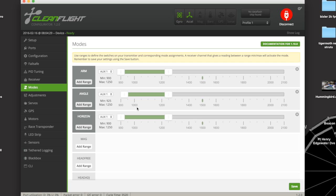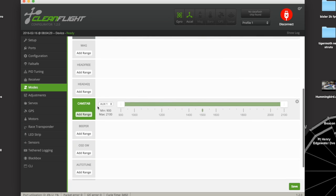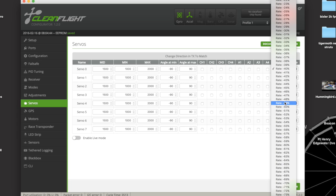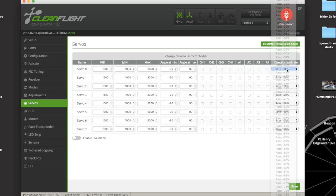Now we go down to modes, scroll down to cam stab, and just make that range full width. That will make sure the camera is in stabilisation mode all the time, which is the way I want it. Then down to servos and adjust the direction and rate. I've got mine connected into servo 0 - I had to drop it down to about minus 40 to get it rotating in the right direction and the right range. You can also adjust the starting level by adjusting the midpoint.